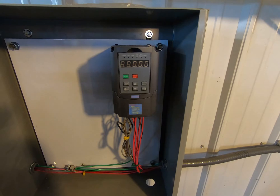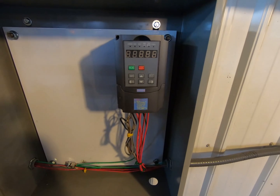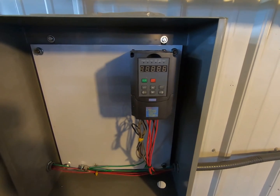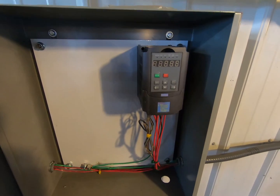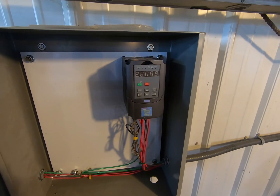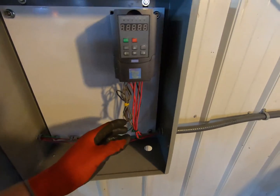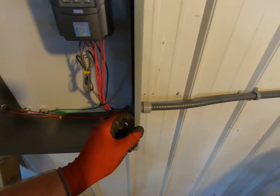We did have to play around with the settings a little bit. Mainly it had to do with the hertz on the motor. The initial default on these drives is 400 Hz, which U.S. electric motors — and actually most electric motors except maybe aircraft motors — will not run on. We also got a ground lug in here, and from there we ran our three wires and ground to the machine.